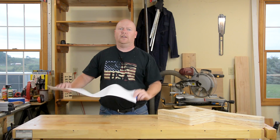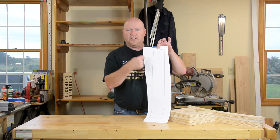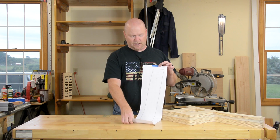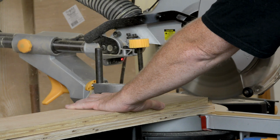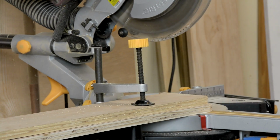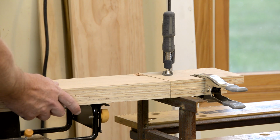The legs. As the last of the sculpted pieces, the sides of this thing are curved, so they're gonna be the same jigsaw flush trim routine, but the 5-degree angles at the top and bottom, we can take care of on the chop saw. I'm set up for plus or minus the correct angle, and I'm cutting the legs in pairs to make sure that the two ends match up. The cutoffs make perfect stop blocks for the angled cut.